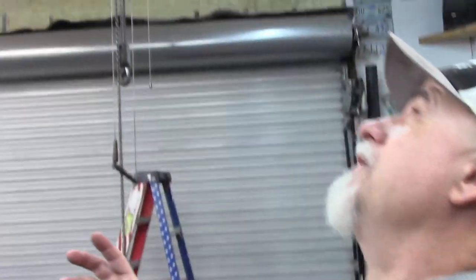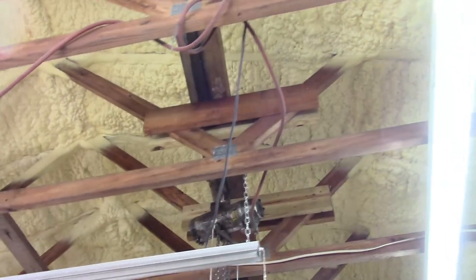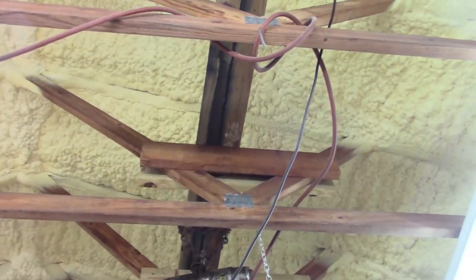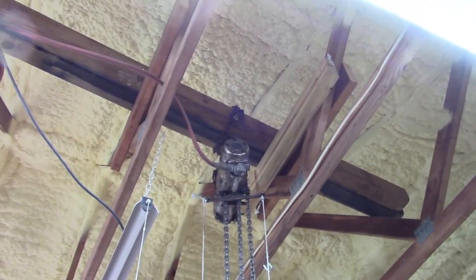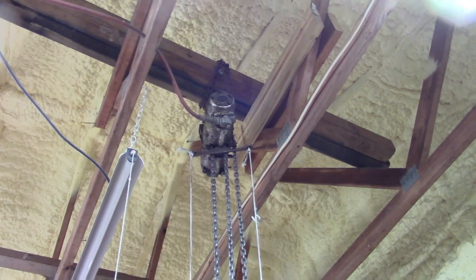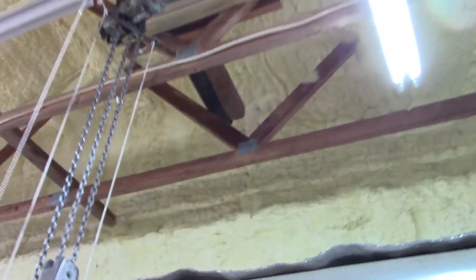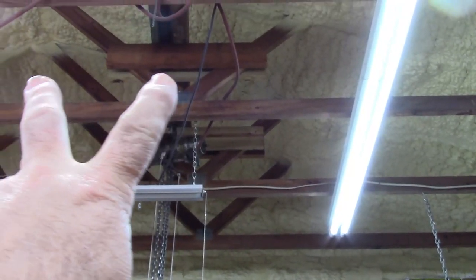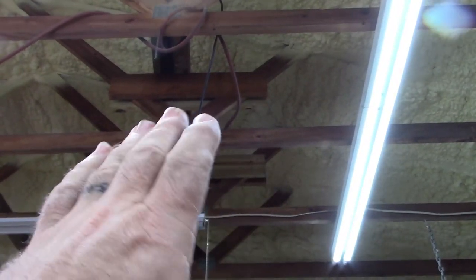What I've done — I don't know if you can see it very well — I have added two by sixes across the V of the truss. And then I put two four by fours on top of that. The chain hoist is hooked over top of a chain that's over top of the four by fours. I'm pretty confident with how that is put together, but my concern is the bottom of these trusses. Because right now the weight is being carried by the top — when I push down on it, some of it's going on the truss base, most of it's coming from the top.